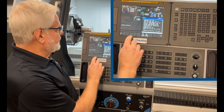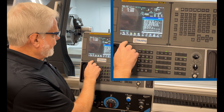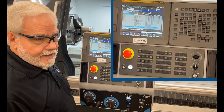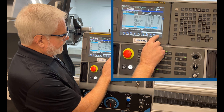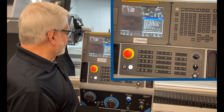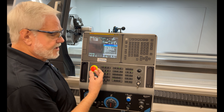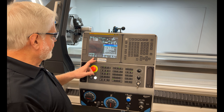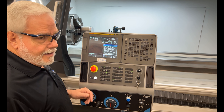Once I select in there, as you see the screen has changed, I can also go into the edit mode. Once I'm in there, I have icons that are selecting different items. For instance, O-List opens up the directory that is in the control, showing multiple programs. If I'm creating a brand new program, any editing I'm going to do is through these three icons: start, cycle, and end. The start opens up the starting menu — the housekeeping to get your tool activated and ready in your spindle. The cycles are what you're going to do with that tool. Once the program is done, the end icon will close it out.